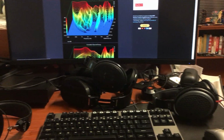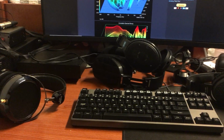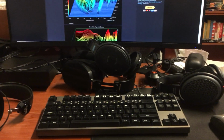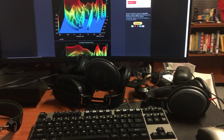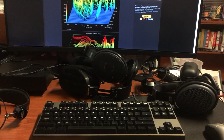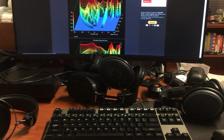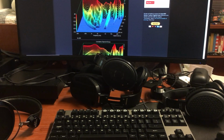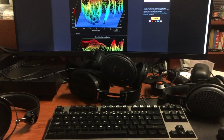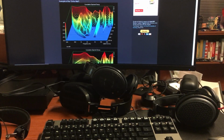I personally find the HiFiMan HE6 has more hard-hitting bass, but for orchestral music, I would still grab my HD600s because they just sound more dynamic, and it is not something planar magnetic headphones can completely get rid of, unfortunately, because as long as it's a planar design, it is going to have some tension on the driver, and as long as it has some tension on the driver, it would have ringing. Whether or not it's audible, it would ultimately affect its Xmax and travel.